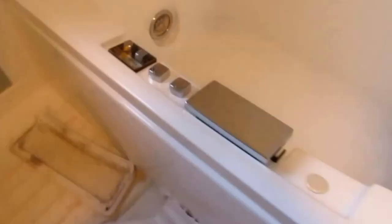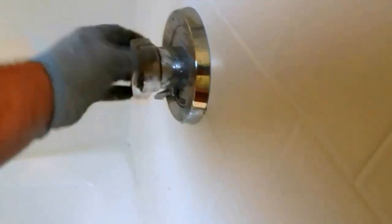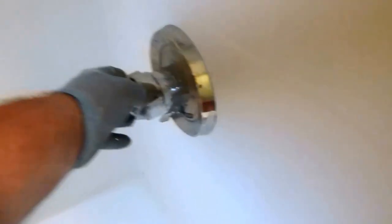I had this toilet valve off — now I'll open it and blow all the water out. Use the air to basically make sure it's blowing any water out, keeping the tank pumped out already. The diverter, these shower valves — you want to make sure you get these diverters back and forth. You can also take these valves all apart if you wanted to. There's a diverter down the bottom — you want to make sure you put a lot of air through this thing.